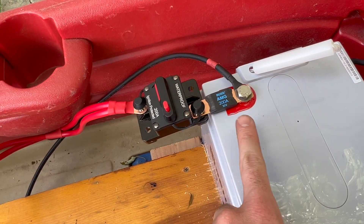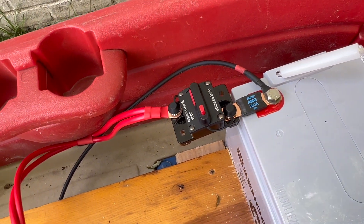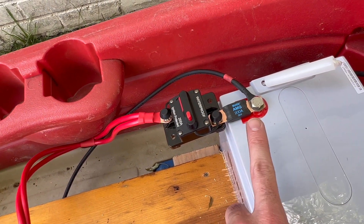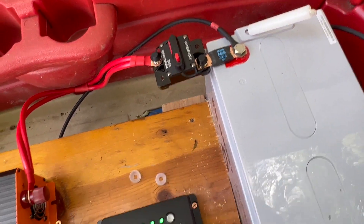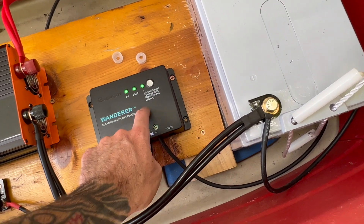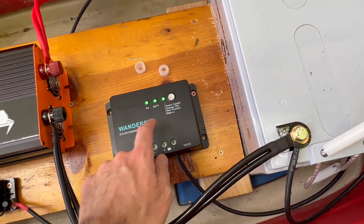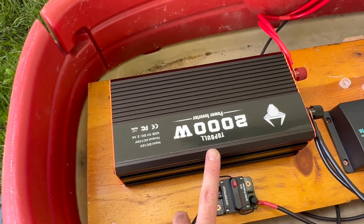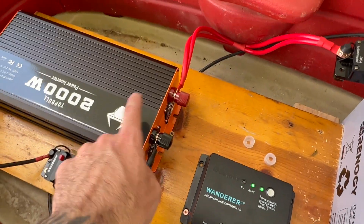As a result I have a little extra weight, but that's okay. Right now I just have a 200 amp fuse and a 200 amp breaker — I know this is redundant, but I just needed to bridge this gap while I'm waiting for more wire and the switch for the wire between the battery and the charge controller. And then this is a TopBull 2000-watt inverter — pretty simple, it came with the wires.